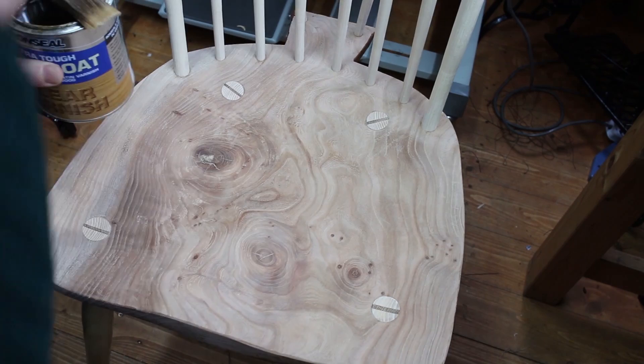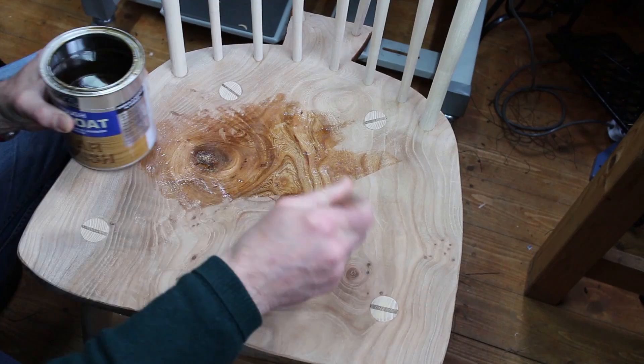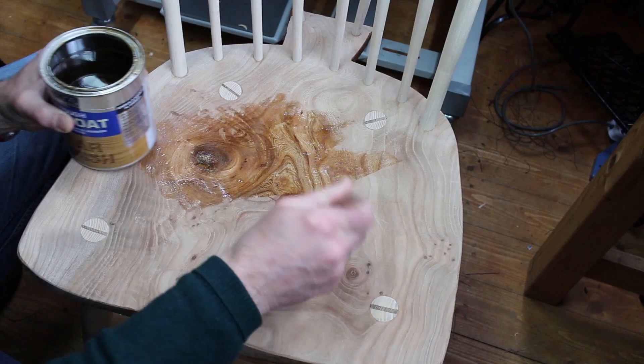I have done this before and I know it can work quite well if you apply it carefully and sand in between your coats, so that's what I'll be doing. I always enjoy the first coat of varnish because you get to see all the lovely grain coming out. Of course you do get to see all your problems as well, so you end up having to sand and scrape and try and sort out where it's not quite right, but it is nice because you put the varnish on and wow, it sort of comes to life.